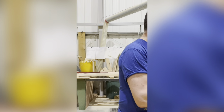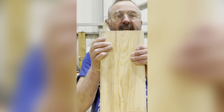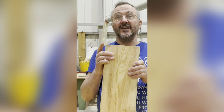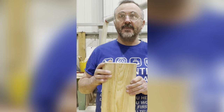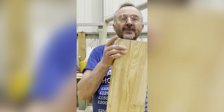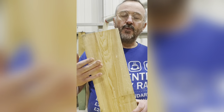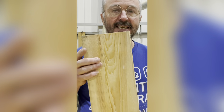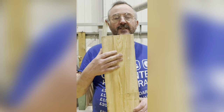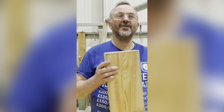The first one is what's classed as redwood pine. It's basically just normal pine — like if you went to a timber merchant and asked for a piece of 3x3, it's quite possible it'll be this stuff — redwood pine. The dark bits you can see in the grain here is sap, so this wood can chew your sanding discs up when sanding because it's got quite a lot of sap content. The moisture content in this sort of pine is probably about 19–20%, something like that.